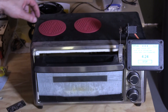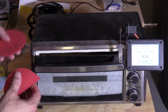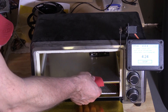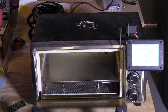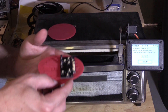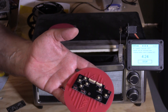Now it says we can remove the boards, but 100 degrees Celsius is pretty hot, so I use these silicone grabbers to make sure I don't do anything dangerous. I just offload the board and put this back and let that keep cooling. The board is still pretty hot, but there it is — we can go let it cool a little bit. They'll cool much quicker now that it's outside, and once it's cooled down we'll go check for shorts and make sure it worked well.